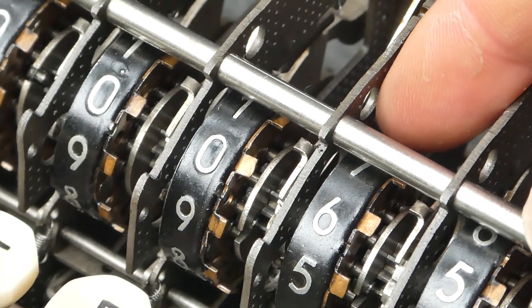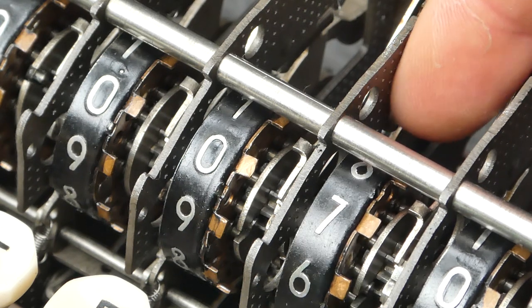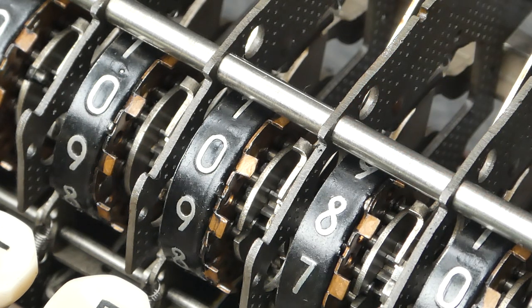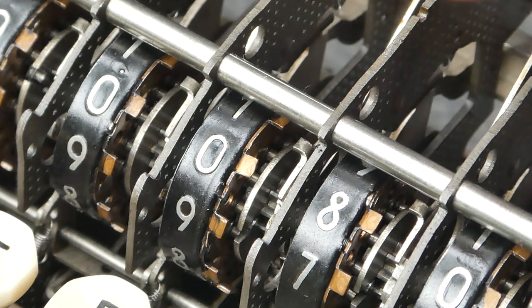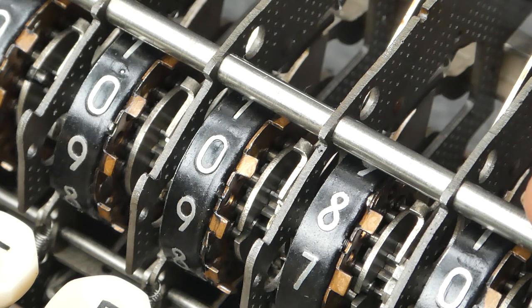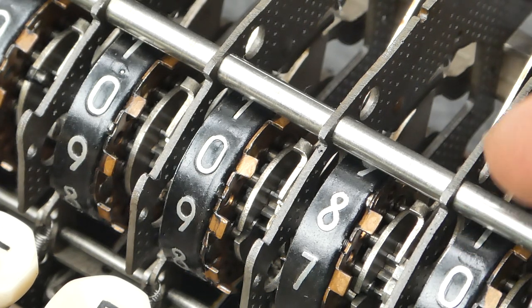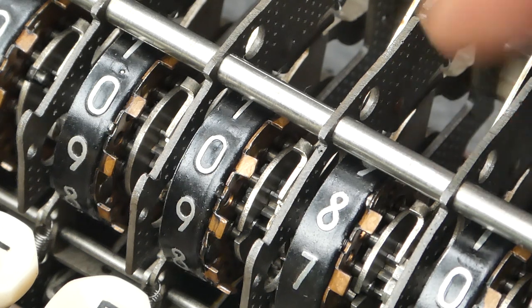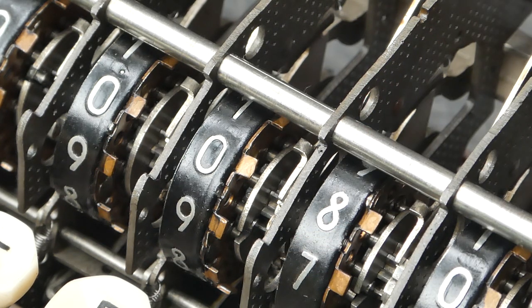I can try and hold this wheel and trigger the carry. It's very difficult to see what's going on. But that eccentric wheel acts as a 10-to-1 gearing mechanism, so while this wheel turns, it winds up a spring, and when it overflows from 9 to 0 it releases a catch so that the axle moves a full rotation. That gets reduced by this 10-to-1 gearing to a single step on this number wheel, and that movement is essentially added to the movement from the keyboard because it acts like a differential gearing system.